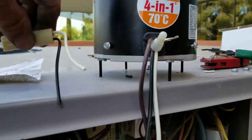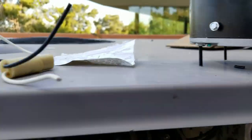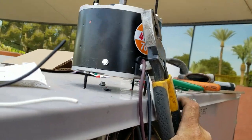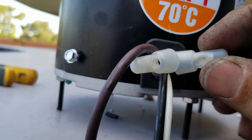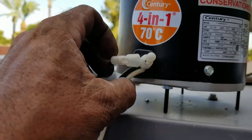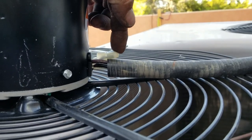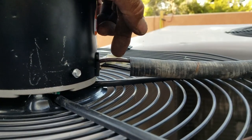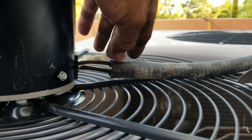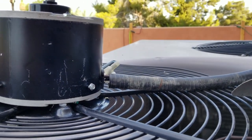Got the motor direction set, the wires clipped. Now putting on the dead end connectors — got to crimp the hell out of them with big lineman pliers. That's crimped on real nice. So these stay real close to the motor, they don't go anywhere. The other wires go into the conduit. I prefer the smaller dead end connectors but I'm out of them. There's enough room in the conduit that I can shove them in there and it's really clean — still much better than people leaving wires sticking up through the fan grill.